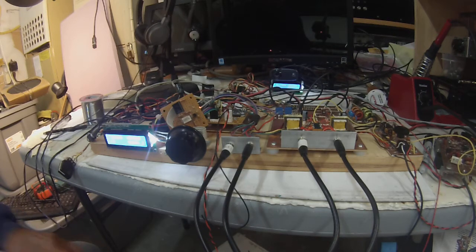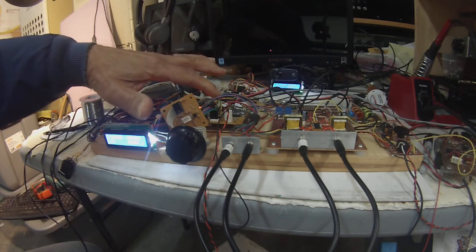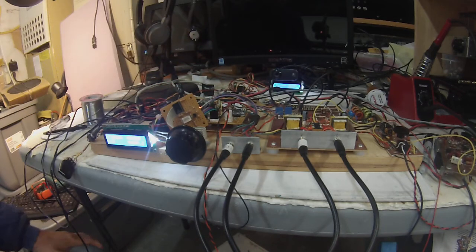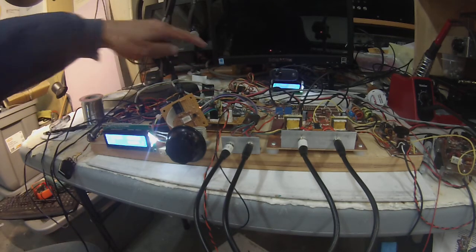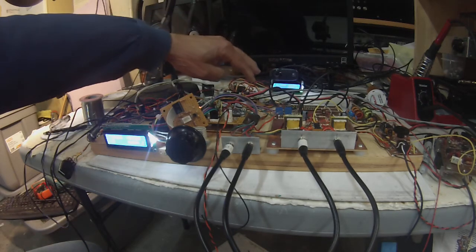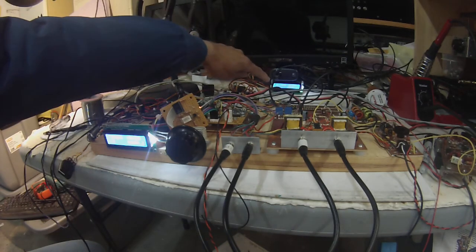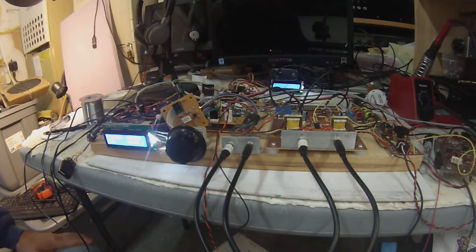Essentially the configuration of this radio right now is that I have bypassed the single output 28 megahertz coming out of being driven by the Teensy 3.5, and sitting in the back here I have an Arduino Nano, or Uno rather, that drives 2 outputs out of phase by 90 degrees, and then we have put a simple little LCD display in the background to keep track of it.